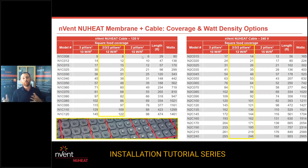When figuring out new heat cable and membrane, the number one most important thing is to calculate your heated area. You want to figure out how much heated area you need for that space — subtract the vanity, subtract the toilet area — and you get the heated area you need. Then you select the cable spacing so you can figure out what cable kit to buy to cover that square footage. That's about as easy as it gets. It's not complicated. Once you do the first job, you realize there's nothing to worry about.